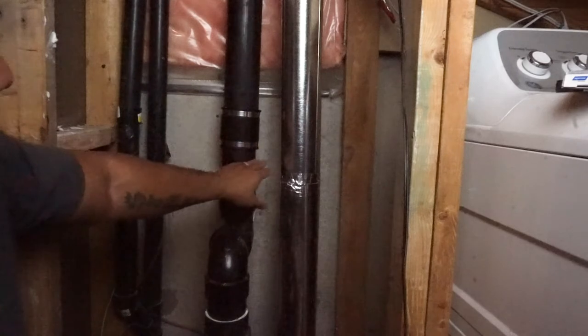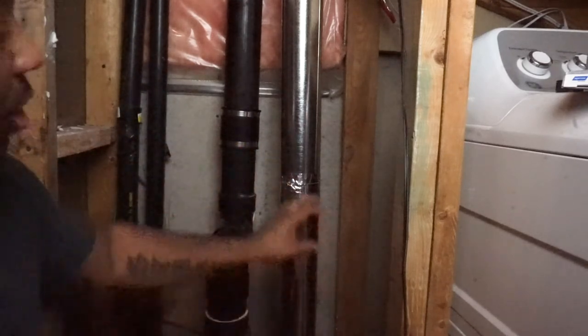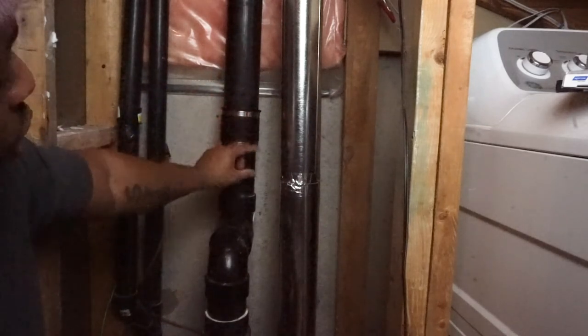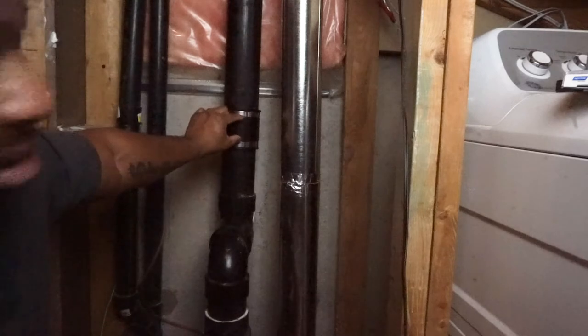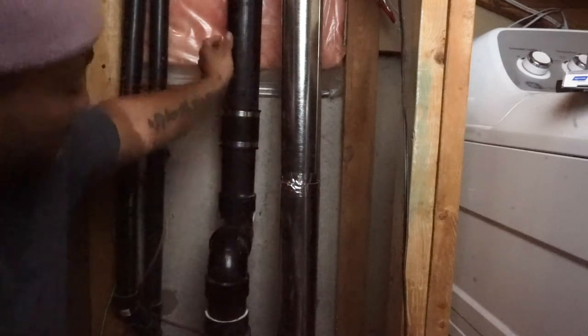You'll notice that the first one I cut, I want to get as much coverage with these two ABS behind here. I didn't want to cut it super short and only have a little bit here and a little bit here. I want to make sure that there's a sufficient amount that this sleeve is covering on this ABS